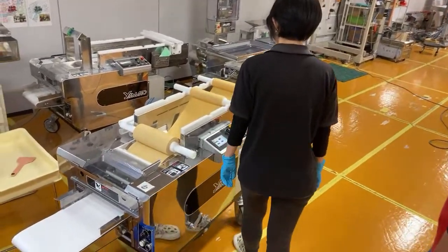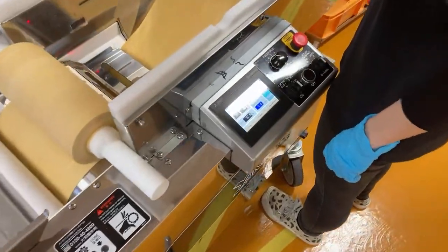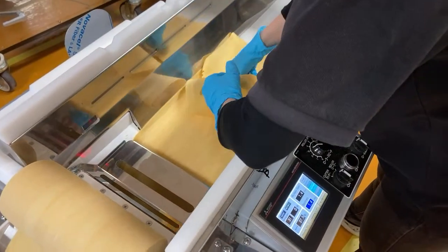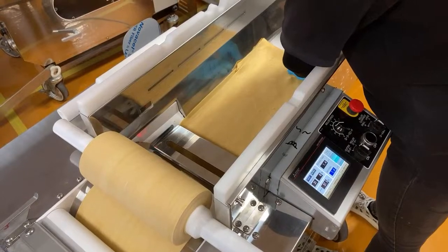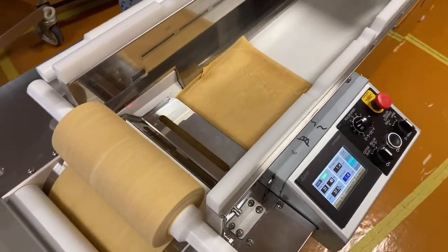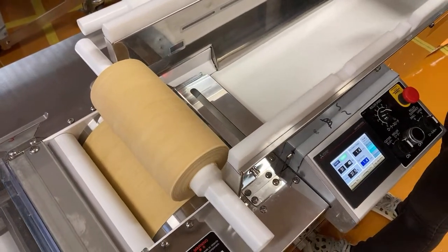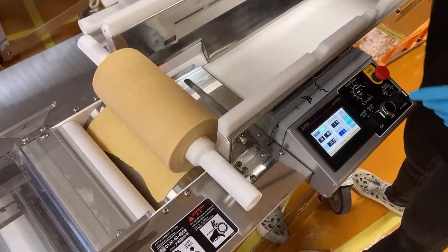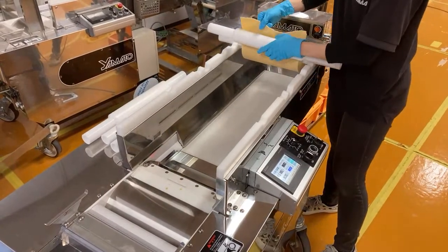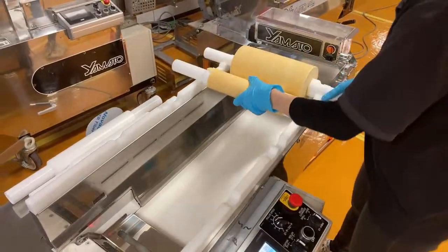In this process and the previous process, the machine is going slow on purpose. In this process, we want to apply good high pressure on the dough to develop the gluten structure, right? So Richmond Gold is working slowly on purpose, so it knows the appropriate speed at which it should roll at this phase of the production. That's a built-in feature, and that allows anyone to make great noodles, as good as well-experienced noodle makers can make, and keep on making them consistently.